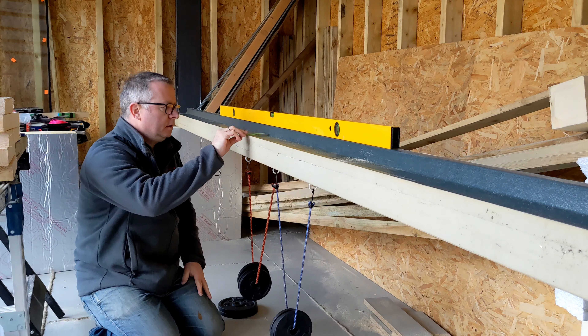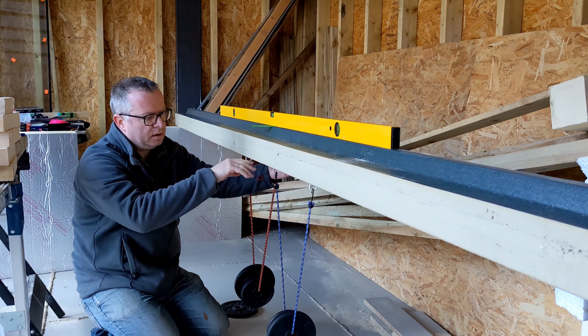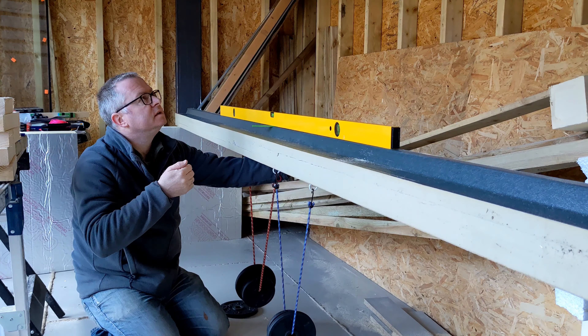That's 12kg over a metre and the packer will go in now. So that is a slight deflection of about half a mil from 12kg over 3.4m. Worth bearing in mind this test piece is only 17cm across and has just one ridge. Up on the roof they're one metre wide and have three ridges per panel, so the glue area holding the inner panel to the insulation is much wider — there will be much more support over the roughly 600mm between each batten.